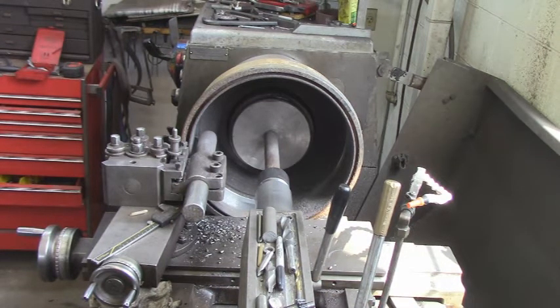Hello, Gary here. You've been searching on how to take the vibration out of turning a brake drum on a conventional engine lathe. This is my crapola setup — as you can see, it's really jury-rigged. A fella brought me a 17-inch truck brake drum. What you see in the middle there is a homemade cup, which I use for most automotive brakes to take the vibration out normally.